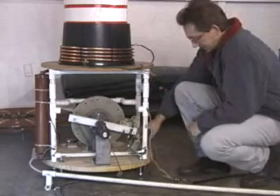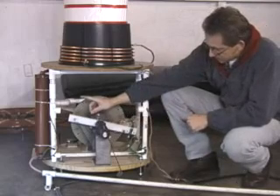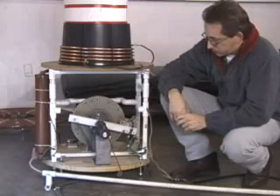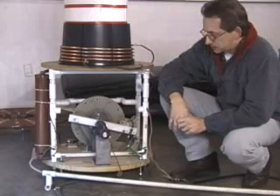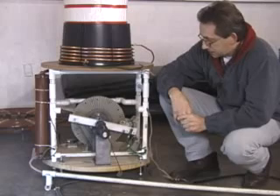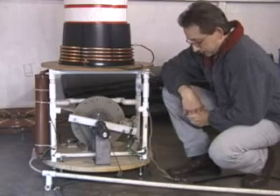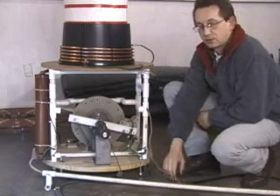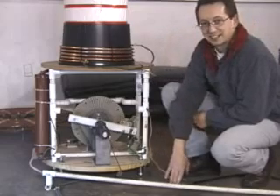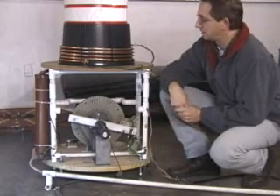The other miscellaneous items: I do have a safety gap connected across the spark gap. I have a capacitor bank that's .06 microfarad total, built of three .02 microfarad capacitors in parallel — those are 60 kilovolt professional pulse caps, polystyrene, made by CSI. I have an RF ground right here; I actually drilled a hole through the cement and pounded an 8-foot rod down, and I'll never take it up again.